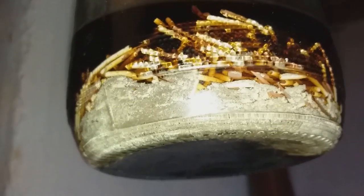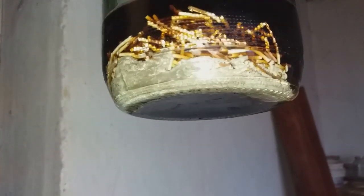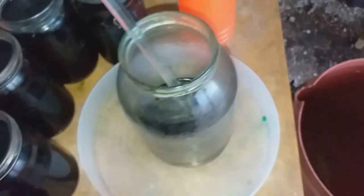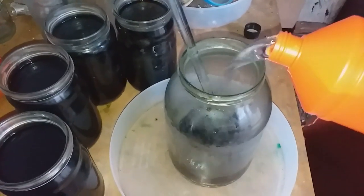See all those silver particles on the bottom — they're heavy particles. If these were gold-plated pins I'd be very very satisfied, but for silver unfortunately it's cheap. So right now we'll add half a liter of new acid.